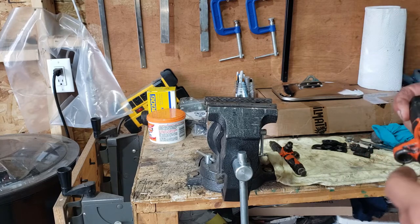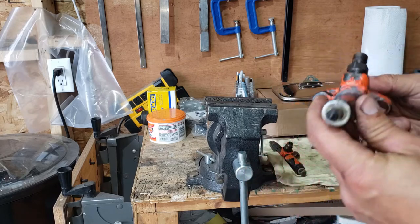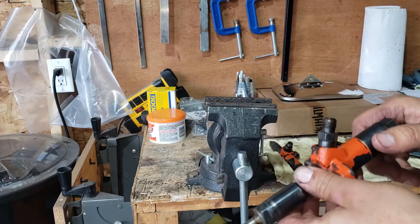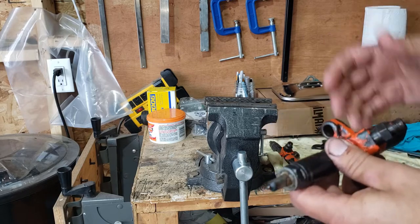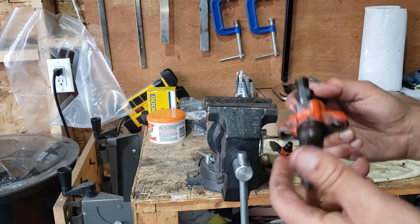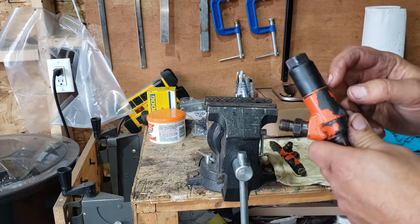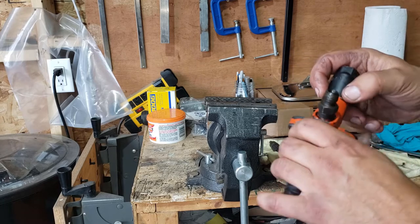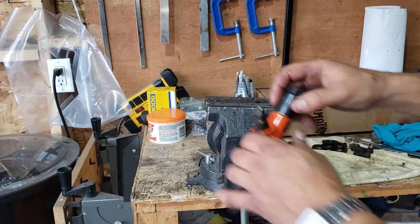3,200 PSI. So I'm going to take these injectors here and turn up the opening pressure on them just by setting the spring inside. I'm going to see later if that works any better. So if you have a similar injector like this, to change the opening pressure, you have to change tension on the spring inside. So we're just going to remove this cap first.